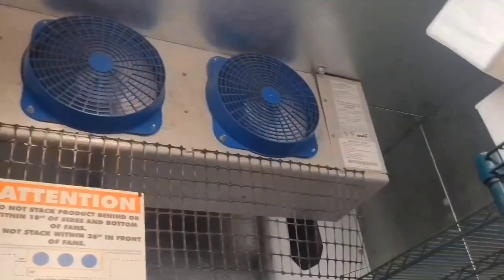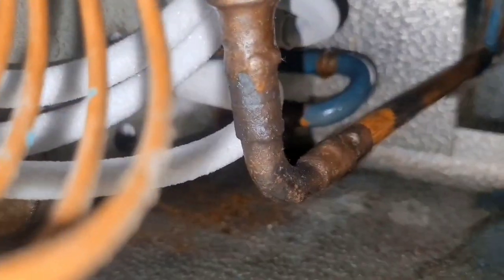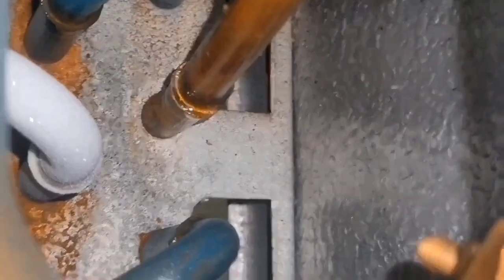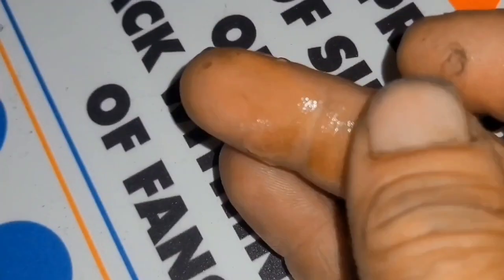I'm going to take this little panel off and pop off the sides. You can definitely tell it's low on refrigerant — you can hear the liquid and vapor kind of surging through the valve. It might have a leak. Yeah, right here, looks like on that liquid line coming into the dryer — got some oil. Oil right there, my friends. That's oil.